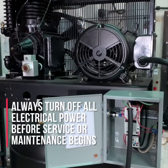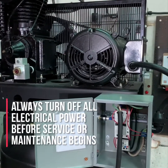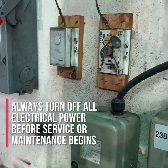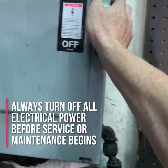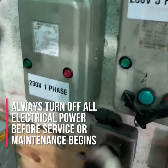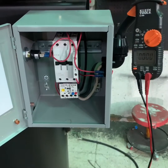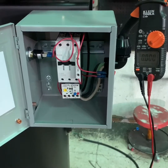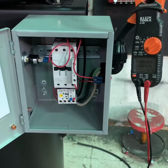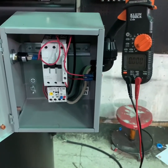The first thing you want to do before working on any electrically driven air compressor is to make sure the compressor itself is turned off. The power to the compressor is turned off and, if possible, the air compressor is unplugged from the power service. Once you're sure you've turned off the power and disconnected any additional power sources, use your multimeter or an amp probe to check that there is no power being delivered to the air compressor.